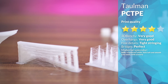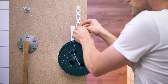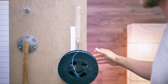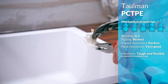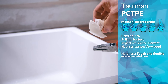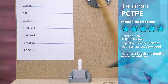In the technical quality tests, it did perform reasonably well, and I also like that it doesn't have that typical harsh plastic feel to it. As we get to the mechanical tests, things get really interesting — the more materials I test, the more I realize the strength scale might be a bit too short. PCTPE would get a whopping 9 stars if the scale didn't end at 5. Temperature stability is fantastic: even though PCTPE is already a soft material at room temperature, under boiling water it actually stays more rigid than PLA or even PET. It's also the most impact-resistant material I've tested so far, with one specimen absorbing the full 1.5 joule blow from the hammer — a first in the series.